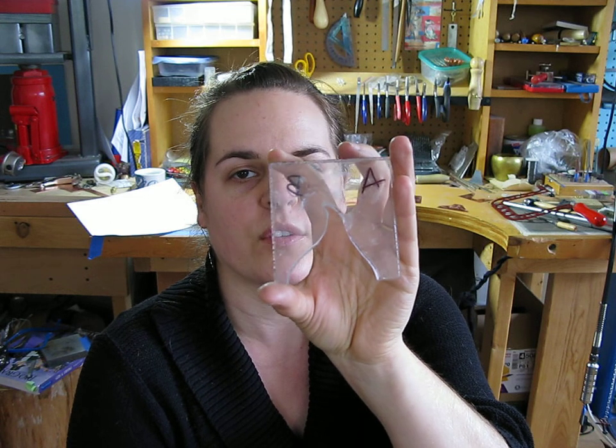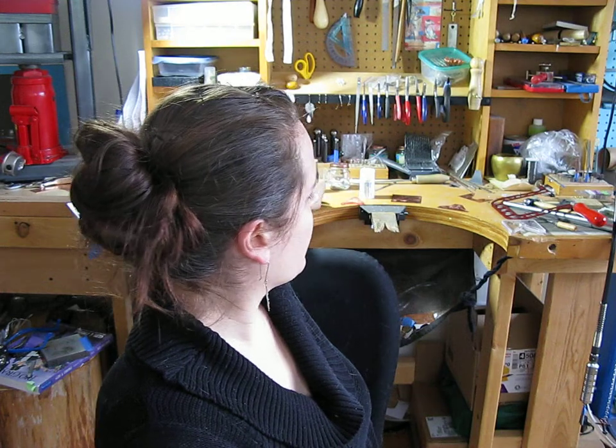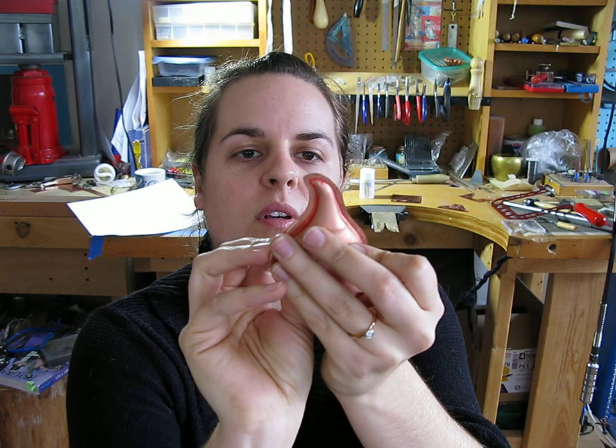For these brooches, the largest one is about 3 inches wide and 2 inches tall and about 1.5 inches, well, I guess wide. And this is the die for some of the smaller brooches. There's going to be 2 smaller brooches. They're shaped like rose thorns, and from that die will come these beauties, which will then be soldered to make a hollow formed rose thorn.